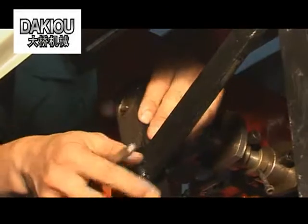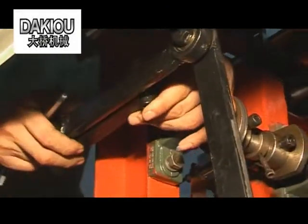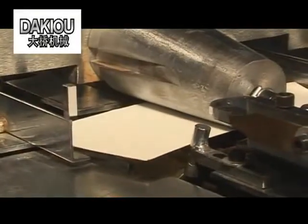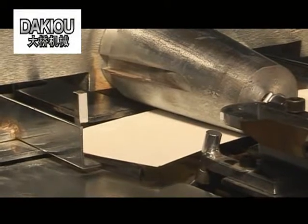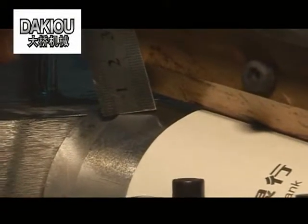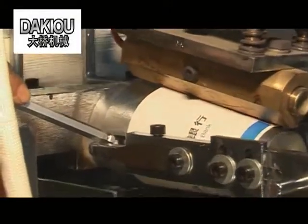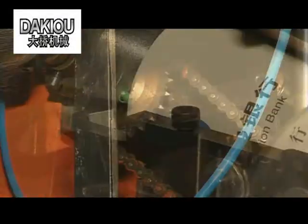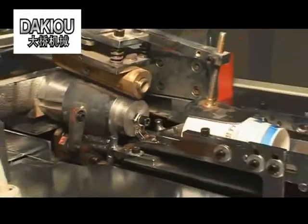If the paper feeding roller and the catcher roller are not in proper position, the solution is as follows. When the hinge starts moving, turn the paper feeder roller swing counterclockwise so that the paper feeder roller keeps 8 to 10 mm to the final point. When the welding copper stick separates 2 to 3 mm, the paper pickup roller will catch the finished paper tube.